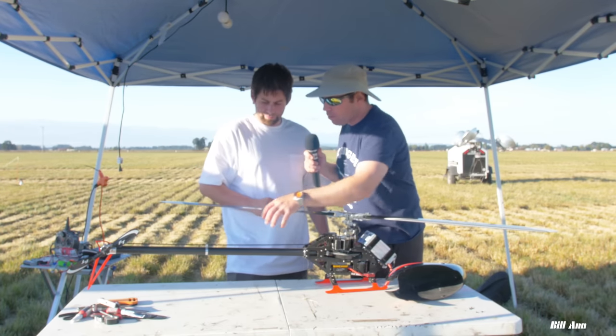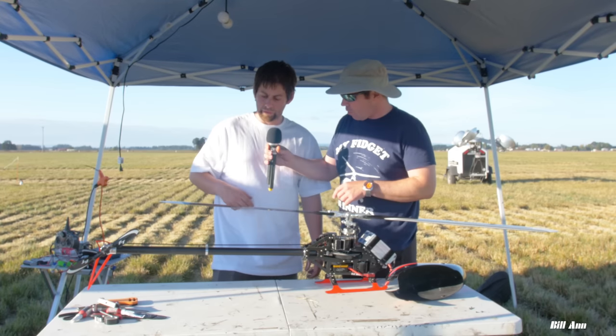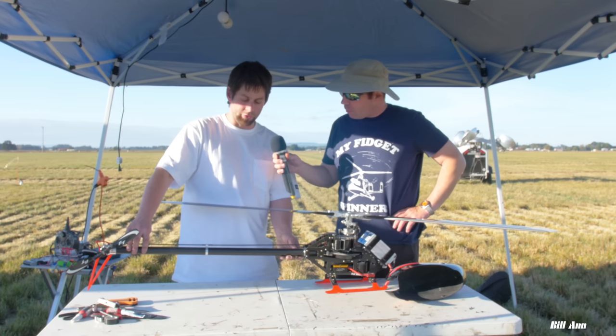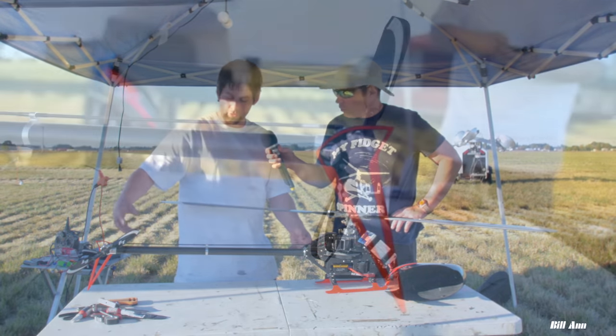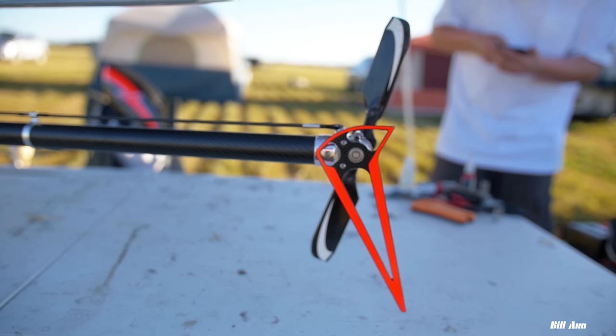The boom is a piece of pre-made carbon fiber tube. But because of the direction of the weave, it's kind of lacking in torsional strength. So I had to reinforce the inside with braided carbon sleeve, which was bladder molded and mixed with resin, to give it enough torsional strength to not have tail vibrations.